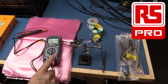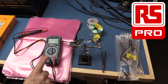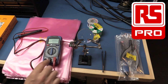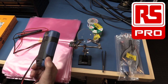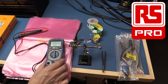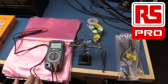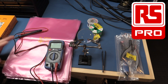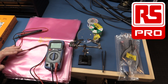It has a separate 10 amp input and a milliamp input which is also common for the volts and ohms. It's CAT3 rated up to 600 volts and has separate high-speed fuses. They're not the same kind of HRC fuses you'd find in a Fluke or Keysight big multimeter, but then again this is not an expensive multimeter. It's only a 3.5-digit multimeter, so its accuracy is only going to be around one percent on each range. The purpose of this is not necessarily for precision measurements — it's the kind of thing you'd have in a toolbox to take out to a site.